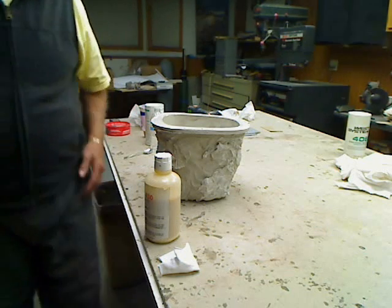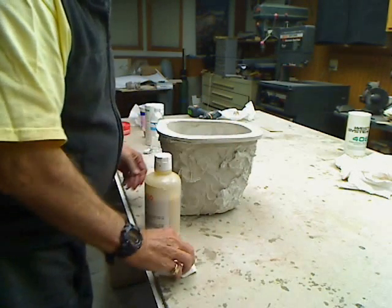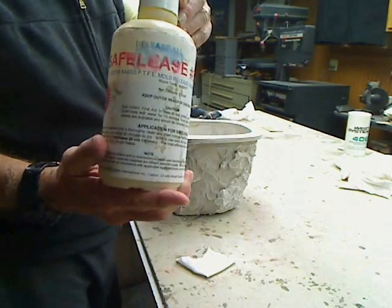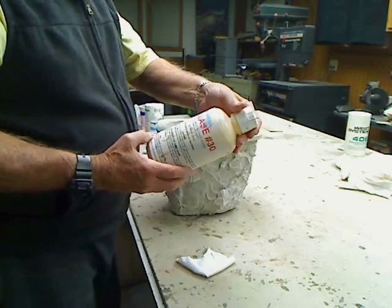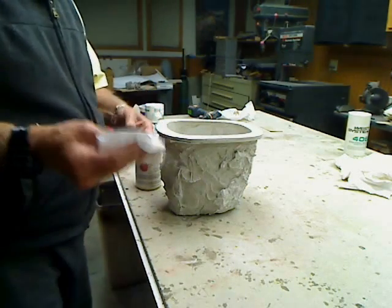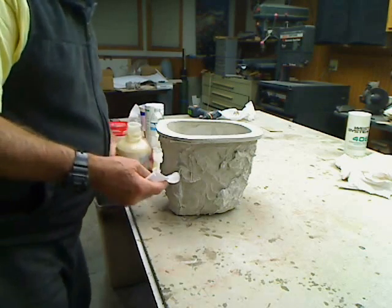The wax is all dry. Now the next step is to put mold release inside the cowl. I don't like using PVA, which a lot of people use — I used to use it because I have such a problem with it fissuring over the wax. So what I use is Safety Release 30. It's a PTFE mold release — it's Teflon, water-based, and has no silicones in it. All you've got to do is wipe on a light coat with a soft cloth.